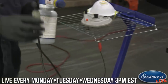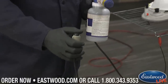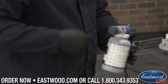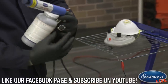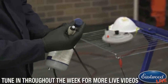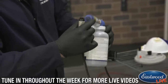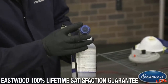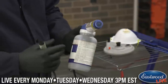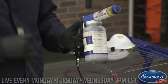It's got the little finger switch — this is what we hit to make the connection and create the charge. When we hit the trigger on the powder gun, it's going to emit the powder out. Because we've got the ground cable connected to the piece our part's sitting on, it's going to make the connection and start clinging the powder to it. We have our little emitter on the end — you want just about an eighth inch sticking out. That little deflector allows the powder to go around and give a nice conical shape when spraying. It gives a softer flow instead of just dumping the powder on, so you can cover it more evenly.